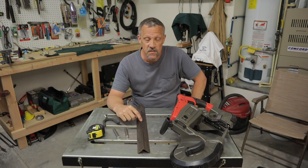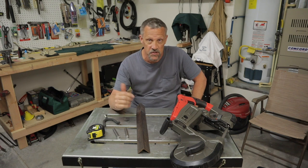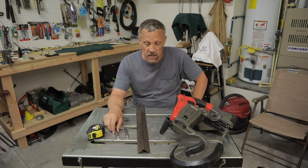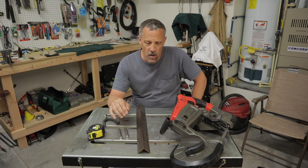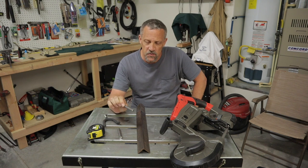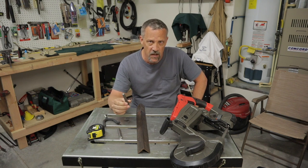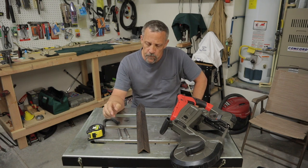I've been using this angle iron for practicing my TIG, since some of you, if you've been watching my channel, know that I just got a new TIG welding machine and I've been trying to learn how to TIG. This would be a perfect project for me to practice with, I think. I'll get some pretty good experience out of it. I don't know about TIG welding rebar. Rebar is pretty dirty metal, so I may have to do some extensive cleaning where I intend to weld it in order to get a decent weld.